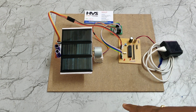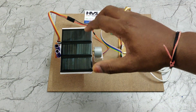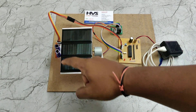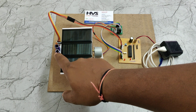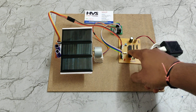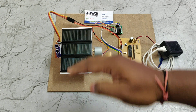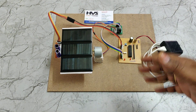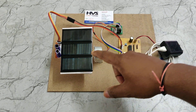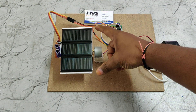To find the position of the sun, we are using two LDR sensors. Whenever the sun moves in a direction, we compare the voltage from the two LDRs. If the voltage from one LDR is higher than the other, the controller knows the sun is moving that way, and the system rotates the stepper motor via the ULN motor driver toward the sun to get maximum sunlight.